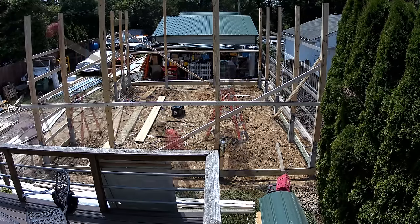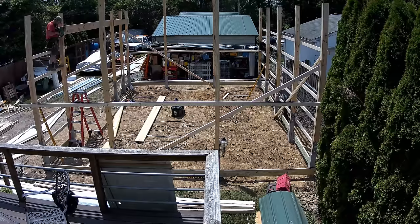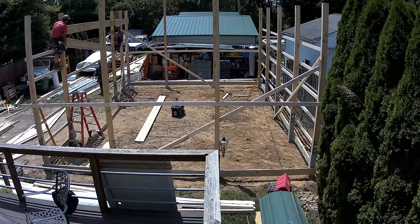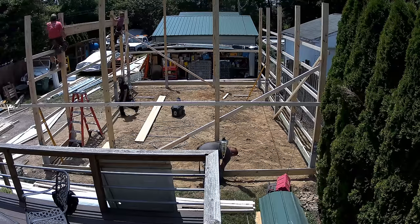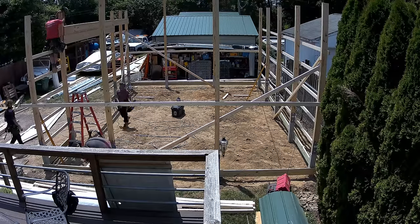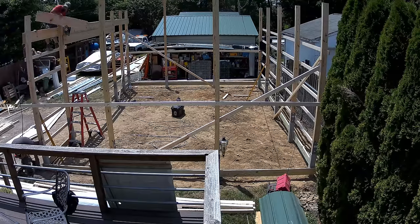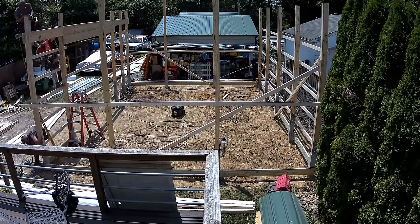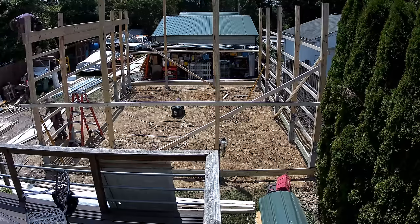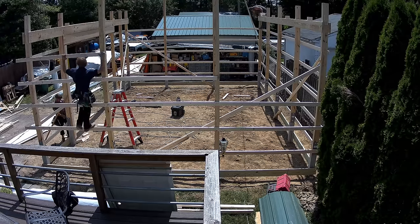That power line is going to be addressed later. Fifteen minutes later you see they got the header going up over the garage door opening - that's a 16-foot opening. He's using nails and structural screws to hold it into place. You'll see some pole buildings actually notch out the posts or put lumber beneath it to support a header, but they do things a little differently here. The board on the left being carried up is called a girder. On the right he's still doing girts, and down on the bottom left in the gray shirt he's putting concrete nails in the skirt boards into the concrete - the permacolumns.